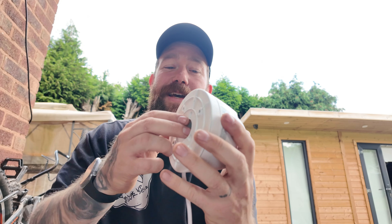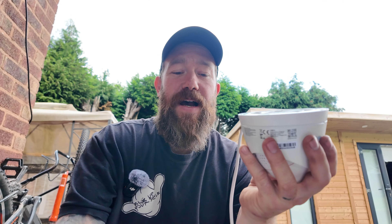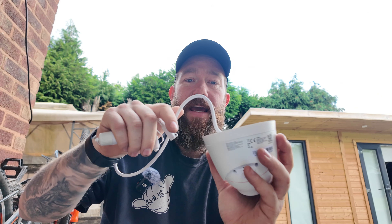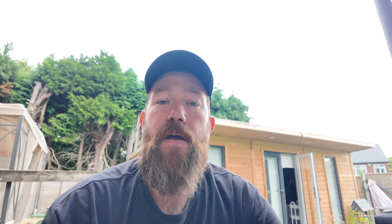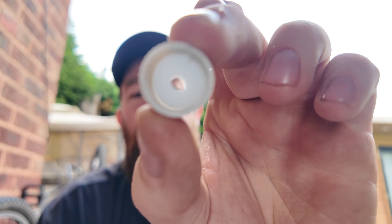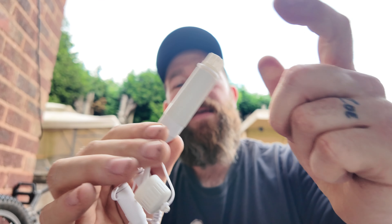Installation is as easy as it gets — the face twists off, cable goes straight through the middle, screw it to the ceiling, twist it back on. If there's no void in the ceiling you can use an adaptable box or adapter plate to coil the cables up. For outdoor connections, I'm fitting an IP adapter for the network socket — slide the Cat5 in, make off the end, clip it onto the camera for a full IP-rated connection.